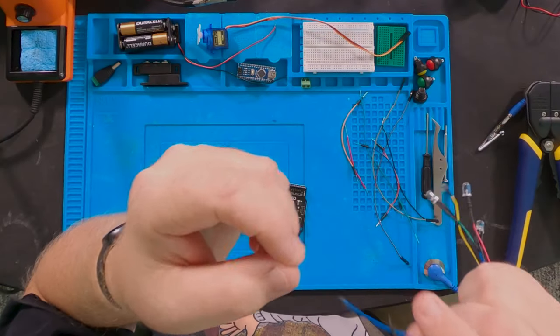First I need to put the wires on the buttons. I'm also going to add some tips on the ends of these pre-wired LEDs I'm going to be using, because when I put them into the proto board they have a hard time going in and don't always make good connections, so I'm adding some different leads to those.